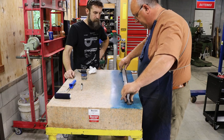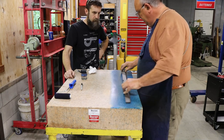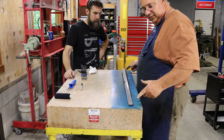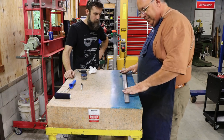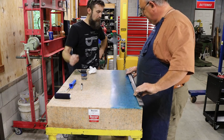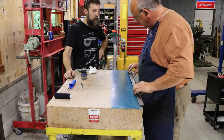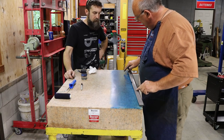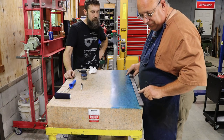We'll drop our part down on here and blue it up. And I'm sitting here just looking. The ends are obviously still high because I can actually see the marks on there, but it's going to transfer over. By marks, you're seeing it in the ink. I'm seeing it in the ink. Yeah, you can see it in there. We're rubbing the ink on the plate. But you can actually see a little mark there. So we're making some contact. It's heavier there, a little bit lighter there. That matches our hinge points.